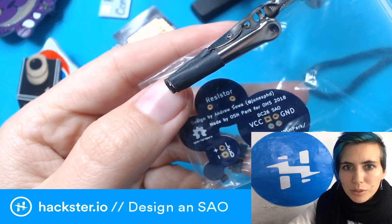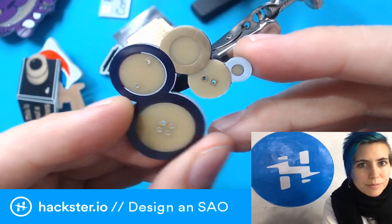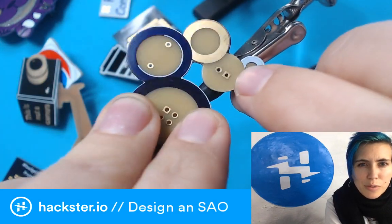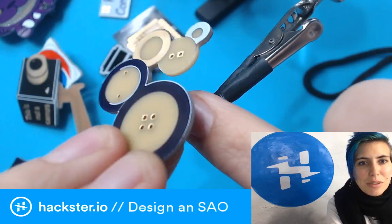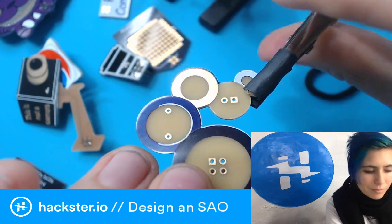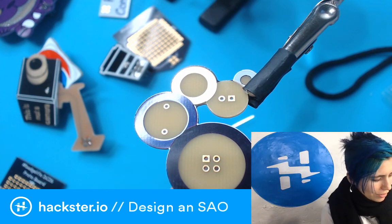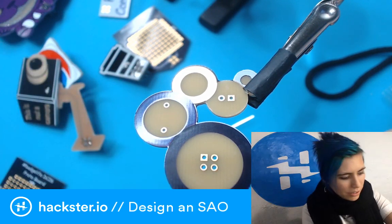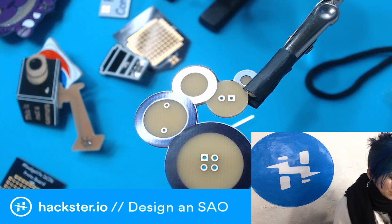I'm going to change my focus so you can actually see what we're doing. It comes with its own little circuit board — very cute. We have an LED and a resistor; it's a 470 ohm resistor, which is quite large for a single LED, but I think it's a color-changing one. And then this goes on your badge, and here you have some little connectors to make the I2C connector.